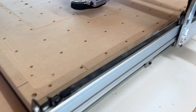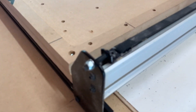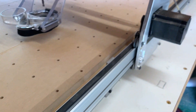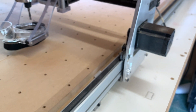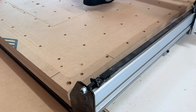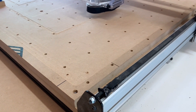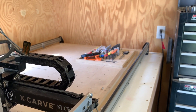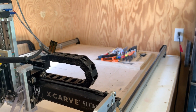The other thing I've done is the 9 millimeter belts. That's highly recommended whether you upgrade your X-Carve to a bigger one or you just want to do preventative maintenance. Along with those belts came the clips. I did get these from TBD CNC as well because they offer them in the 1800 millimeter size.